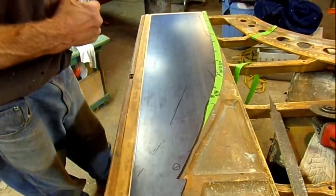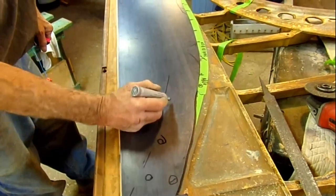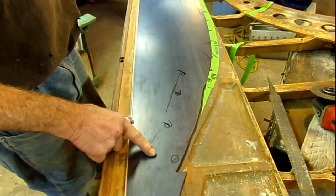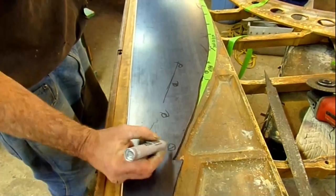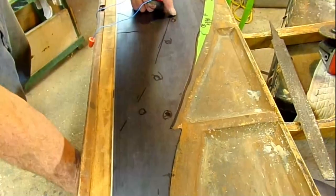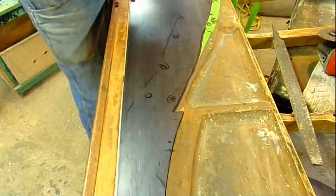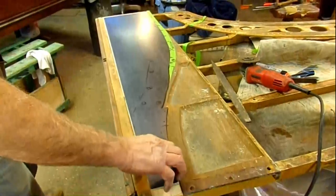And of course we're going to have screws in here. Maybe one there, maybe one there, all along here like this. Screws, countersunk in the steel and threaded into the pin block. Wood screws, big ones. And these will be bolts, threaded machine bolts, right through, coming through from the top and threading into here, like that. And then we file them flush. Yeah, it's gonna be good. All right, that's it for now.